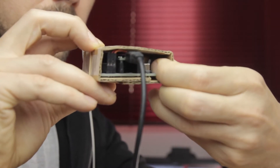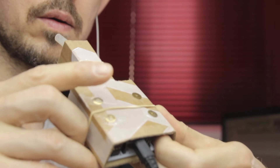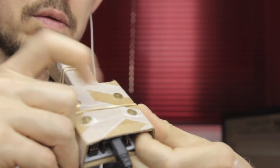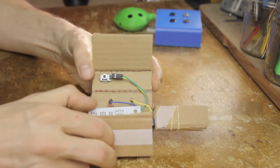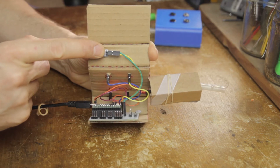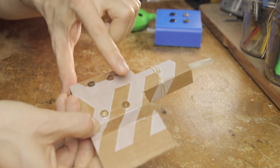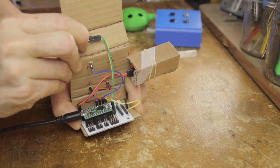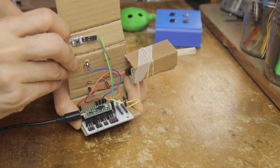Calibrating the Qlik Ocarina is very simple. Just like on all the instruments in the series, you simply press down the calibration button and hold it pressed while you activate all the sensors. This is the sequence: press the button, wait for the LED on the TNT to switch on and off again — that's about a second if it's hidden away inside the instrument. Now activate all the sensors, then release the button. Calibration is now complete, but hasn't been saved to memory yet.